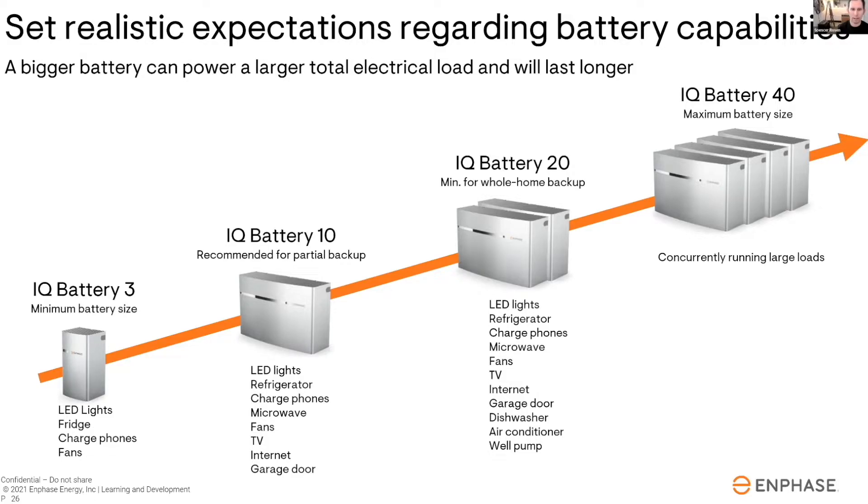Can it handle three refrigerators? If those three refrigerators are on three separate breakers and you do those three refrigerators plus one lighting circuit, sure, why not. The amount of power during the daytime is going to be a lot, typically depending on the size of the system. You've got to use your judgment — if it's a 5kW solar system I probably wouldn't put three refrigerators on there, but if it's a 12kW solar system with two refrigerators on one outlet and another refrigerator on another outlet, I'd put that on sunlight backup.